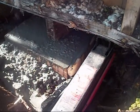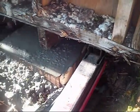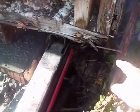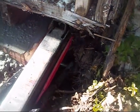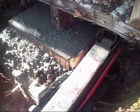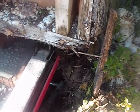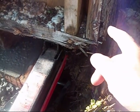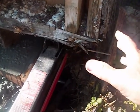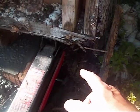Okay, so I've just finished pouring the cement or concrete. As you notice, it's not on the corner, it's actually in one joist, and the reason for that is this down here is totally rotten, so there was no sense pouring cement there, and because it was in the ground, I couldn't even replace it yet. By doing this, it will get the shed up off the ground, and then I'll cut away this bad board and replace a new floor joist and the corner boards here. And then I'll pour another concrete slab right down here at the bottom on the corner also.